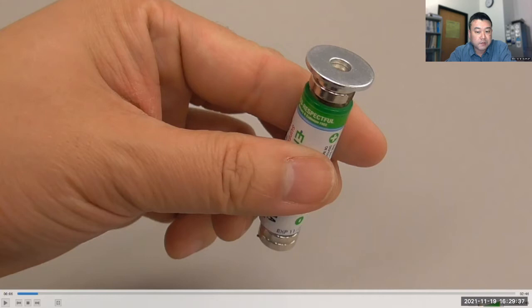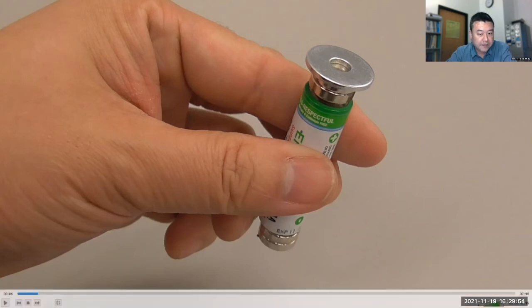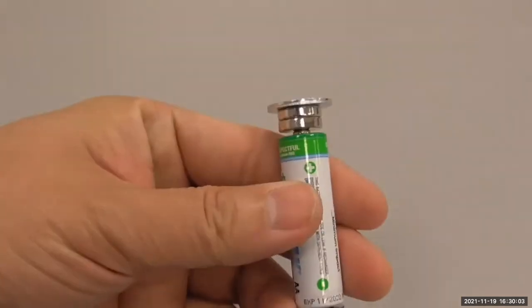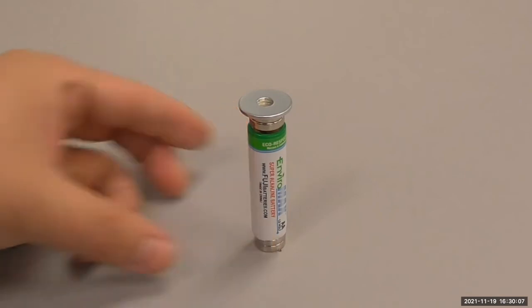And this washer up here is not necessary for any electrical or magnetic reason. It's necessary for a mechanical reason. I'm going to place the wire in this well so that it doesn't fall out as easily. So that's the whole setup. I have a bar magnet with a voltage source that can provide the current for the wire I'm going to touch. That's one part of the homopolar motor.